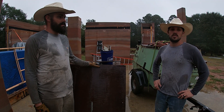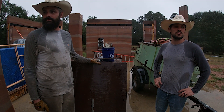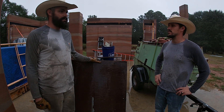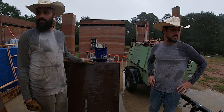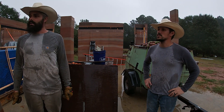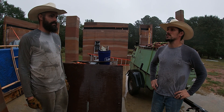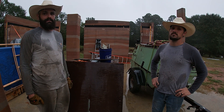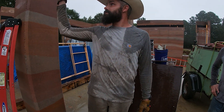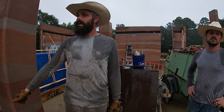It's supposed to rain today and tomorrow. I don't think we want it to sit wet for that long — that's the issue. If we get the easy up over here, we'll get our tools and it won't be that fast. We've already got one of our big turnbuckles made; this one we can probably use for the second. We can pull one from here to that corner over there. All those are doing is keeping it from going anywhere, because it's going to be essentially freestanding at the moment. As many turnbuckles as we can get on it. On that wall we can actually go directly into the rammed earth, and on the wood one we could go directly into the wood — and then lower we can have turnbuckles.